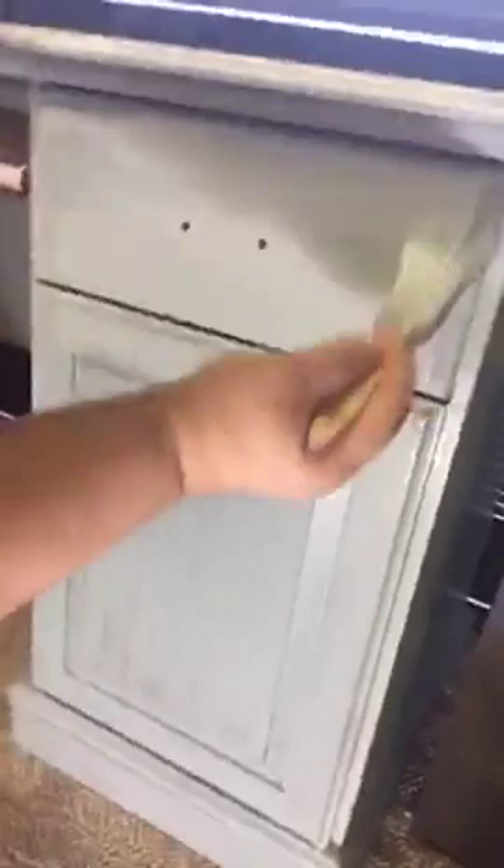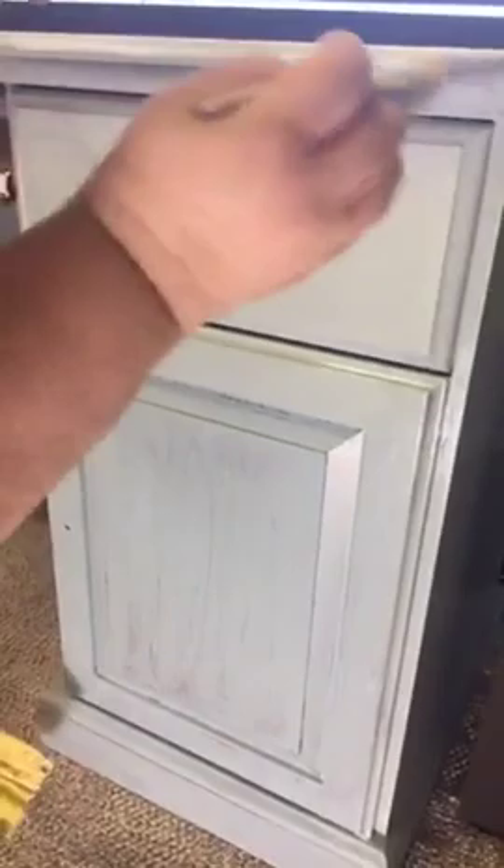Look — from the fan, we're already dry! That's why you turn a fan on. I'm going to put a second coat on this cabinet because there are a couple of places that aren't totally covered, and I want to show you what happens if you paint your second coat too soon. On the second coat I want a little bit more paint since I want this to be my last coat, but I don't want drips.